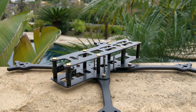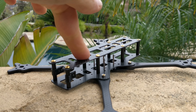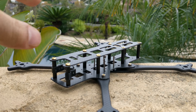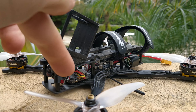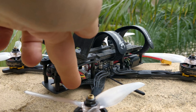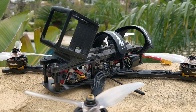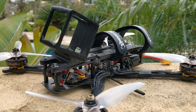This is the heavyweight version. The standard weight version has five millimeter arms and two millimeter plates with a chamfer on the arms. The six millimeter, 2.5 millimeter version does not have a chamfer because the chamfer adds a good amount of cost. You can chamfer it yourself if you like — the edges are soft, not really sharp. The regular version is now 97 grams.